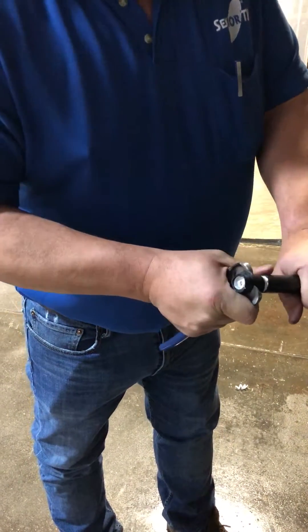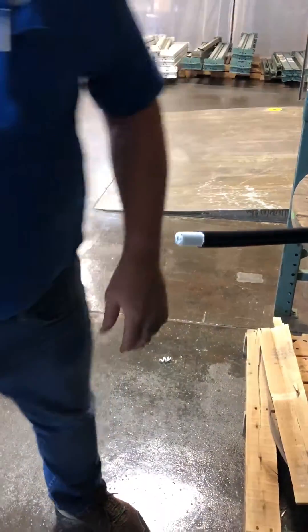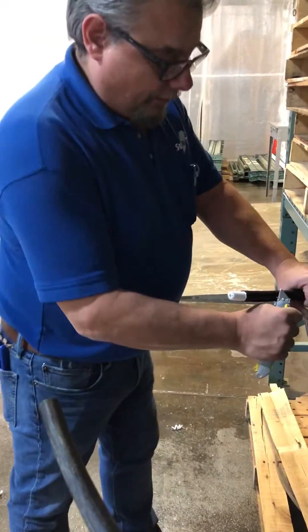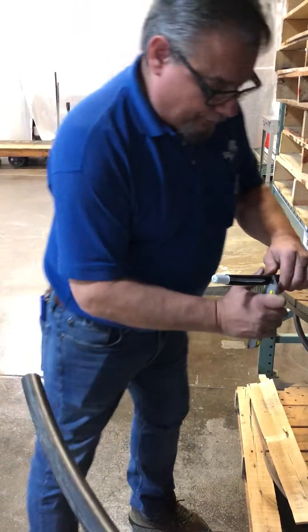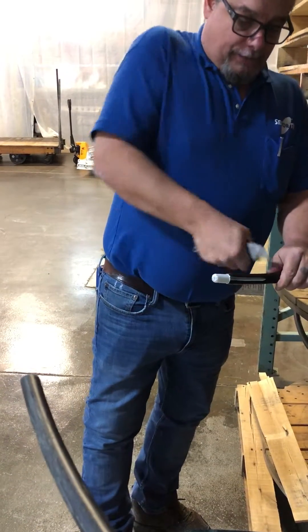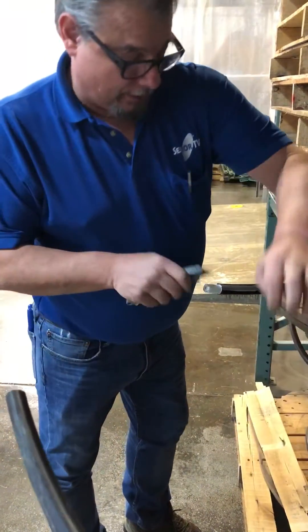Pull the black jacket and the metal jacket off. Then I'm going to take a utility knife and strip the outer jacket off so we can get our cord to run down here. Some people, if you're real good, you can kind of score it around here, but if you do that you have to be very careful that you do not score the metal jacket, otherwise it can come apart just like we did there.